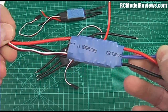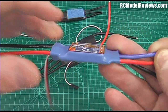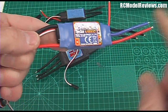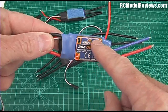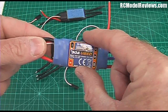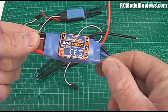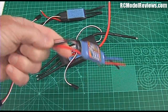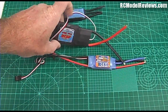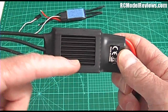That's basically what you get inside the heat shrink — lots of components soldered to a circuit board with a little heatsink. As I've shown in previous videos, if you want maximum reliability you want to cut away the heat shrink and expose some of the metal underneath — just enough to expose a little window. That enables heat to escape far more effectively, because the plastic heat shrink is an insulator that stops the heat getting out.